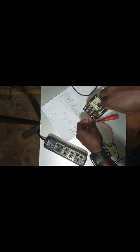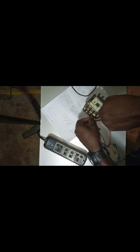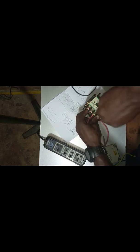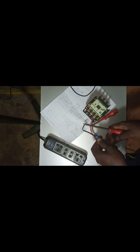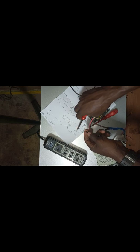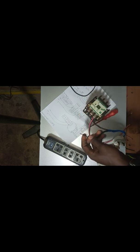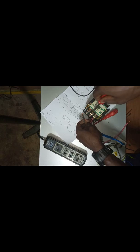Alright, L1 and L2 — so this one is my L1 and this is my supply cable. I'll use two of them. Tighten firmly so there will be no partial contact. And the other one: the neutral point goes to L2, and the L2 goes to A2 of the coil. This is the coil of the contactor. So I will connect this to the neutral cable.